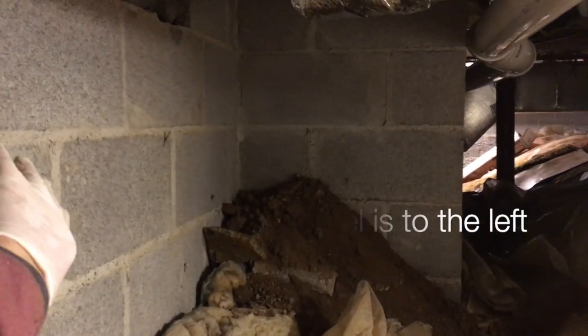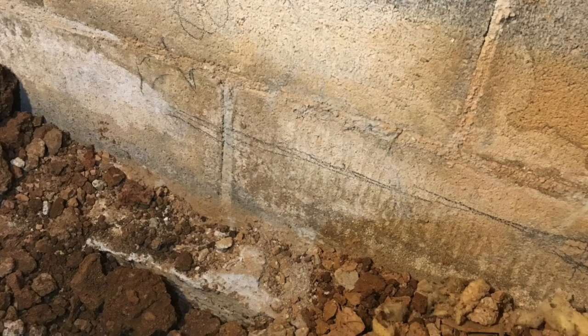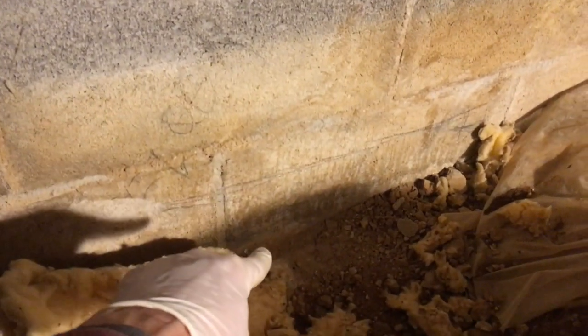I'm tapping into the slab of the basement, way on down there. Why didn't I do it here? Well, I know a little about a lot, but not everything. There's a footer right there, and for some reason it's staggered a whole block higher way over there. I've got it marked — you can see what says 'floor' — that's where the floor is on the other side in the basement. I can't go six inches below that. We like to go six inches below to get under the slab, but that footer's right there.